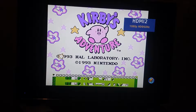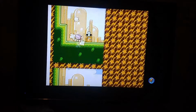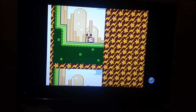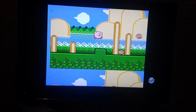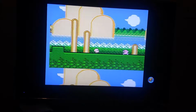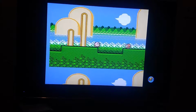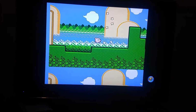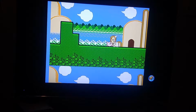And this is what his was doing in his video. File select not working. Everything plays correctly, except for no status bar. So you can see everything is fully playable, just that one IRQ line being broken, so the status bar can't be displayed correctly. It's displaying the previous graphics instead of interrupting and switching the banks on the character ROM.